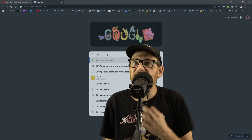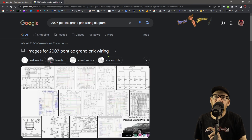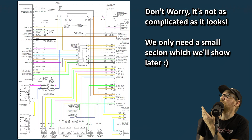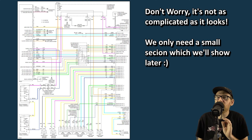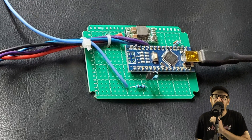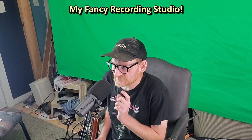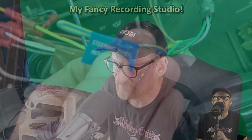So how do you know if your car uses a resistor divider or the CAN bus? The only way to really tell is with a wiring diagram. A simple Google search for your car's make, model, and the words 'wiring diagram' should get you what you need — and this is what I got. In the near future, I'm planning to make an updated version of this project that's more compatible, programmable, and CAN bus enabled. But for today, I'm focusing on what I actually built: an interface that works with my particular Pontiac resistor divider buttons and my Kenwood head unit. It should be easily adaptable to other vehicles and head units.